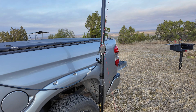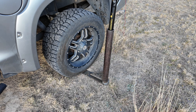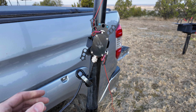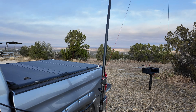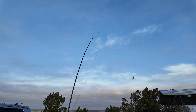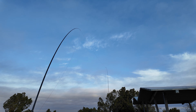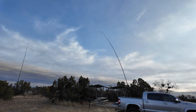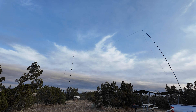I've got the feed point here on a mast, and the mast is on this drive-on mast holder that my buddy built me. It's leaning a little bit because the ground is a little bit uneven, but it should work fine. I've got the feed point with a choke at the feed point, and then I've got a short counterpoise, and then the radiating element goes up to the top of this mast. It goes to the top of that mast — it's really blown over — and then I've got another mast over the end of the wire. The wire is maybe about three or four feet before it hits that mast, then I've got some paracord. The other mast is there, so you can see the inverted L facing almost directly north.